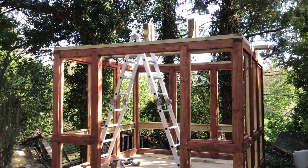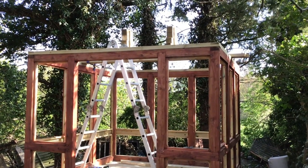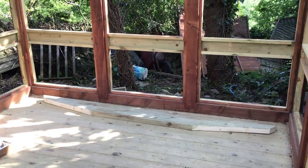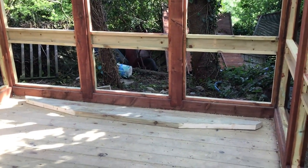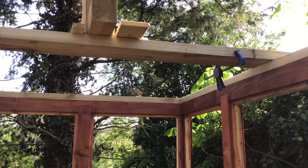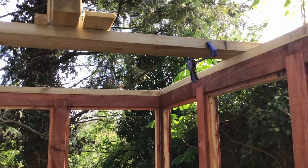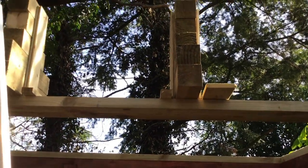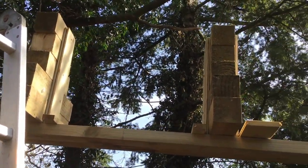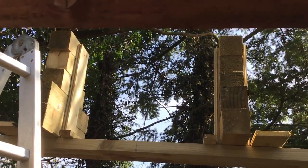The next part of the building is the roof and I'm in the process of putting up a temporary support for the ridge. I've already made the ridge — I've used 200 by 50 timber and cut it to a typical Japanese teahouse shape. In the meantime I've put two 100 by 50 planks across the top where the rafters will sit and built a little frame tall enough to support the ridge. I'll temporarily secure the ridge to that plate, then start measuring out the rafters and fit them as required.